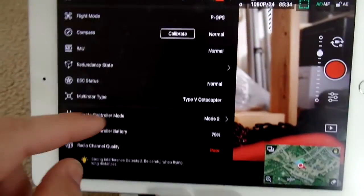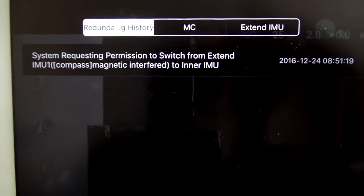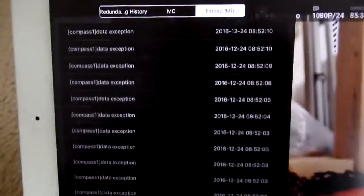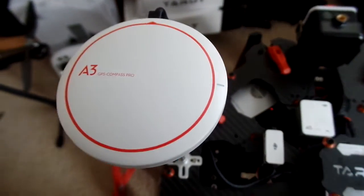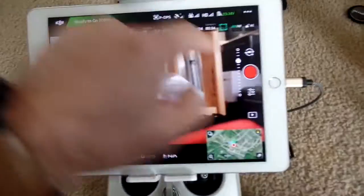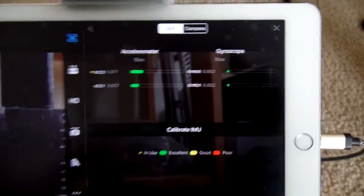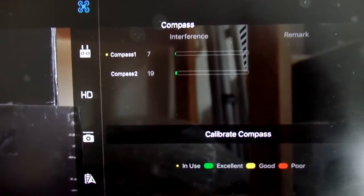If you go into redundancy state, it'll generate a little report. Here's what it said: 'System requesting permission to switch from extended IMU to inner IMU.' And: 'Compass 1 data exception.' So it definitely did something — it has switched. These are green now over here, and it's blue over here. It's complaining because I'm blocking the sky view. So I guess it does work. Under sensors for compass, I guess that's just a bug in the app — it should have switched the in-use indicator to compass 2, because we did switch.